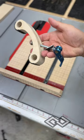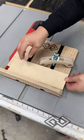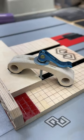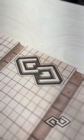Here's our design for a hold-down clamp to be used on the t-tracks for holding down small pieces of wood when necessary. The clamp has a quick release lever which makes things a little bit faster when holding pieces down. We also use the laser on the Avid CNC to engrave our logo and add a half inch measuring grid.